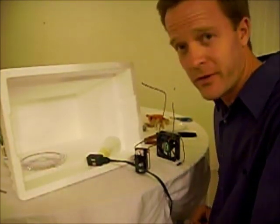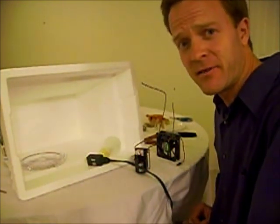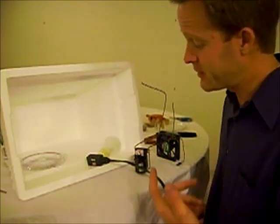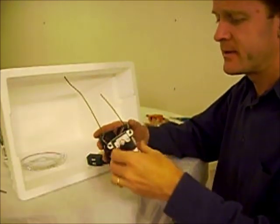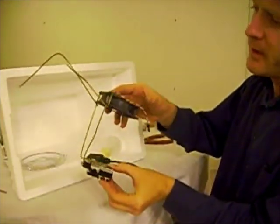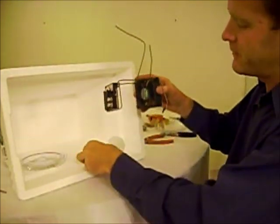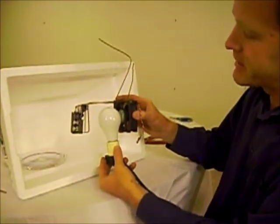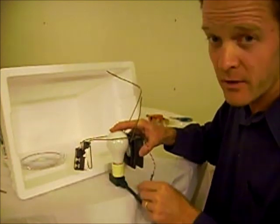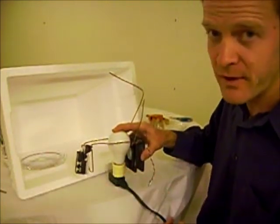For a harness to hold the thermostat, fan, and heater together, I've come up with using a coat hanger — just a simple metal coat hanger laying around the house. The thermostat will tape securely onto it using the same foil tape, and the fan is secured about five or six inches away. The light bulb will be situated so it is very close to the fan. The fan will blow across the light bulb and blow the air into the thermostat, which will help speed up heat transfer and make it more sensitive than it's designed to be.